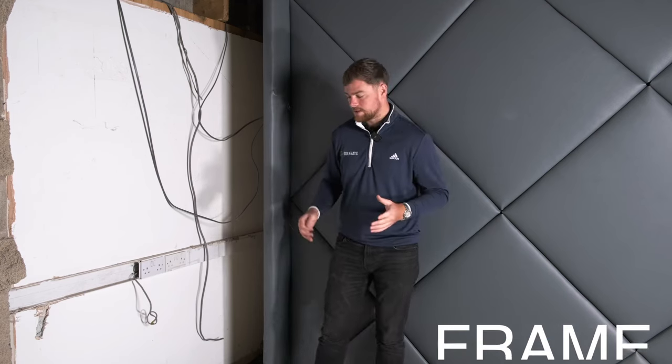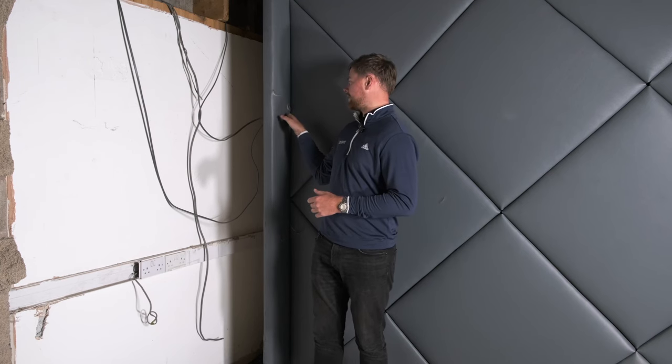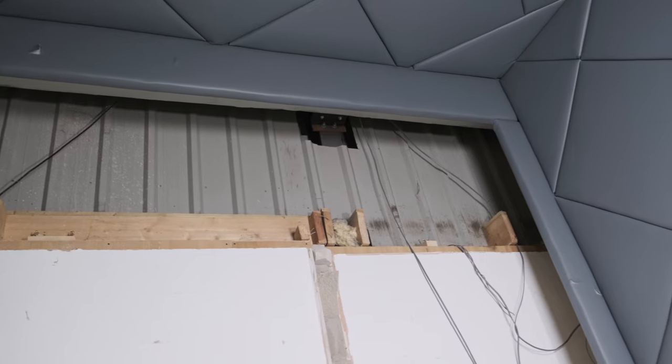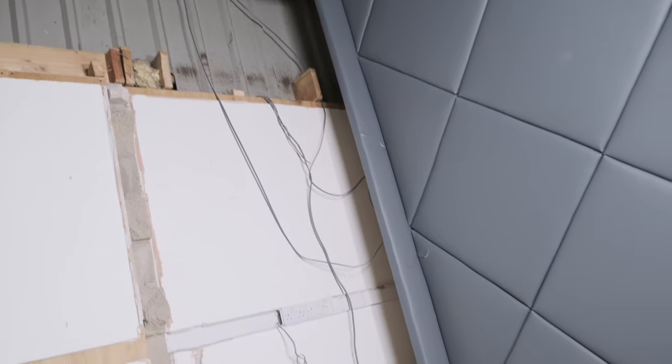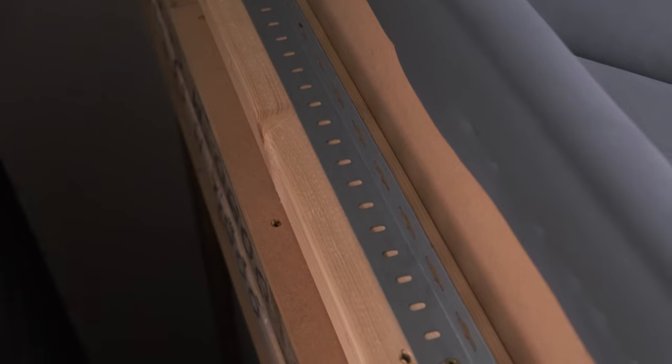The first thing you're going to need when you start hanging your screen is obviously a frame. When we do our installs and we're hanging people's screens we make a timber frame — this will be sort of inside the padding that you see. It goes all the way around the outside; the one we have is about 510 wide by 310 high, to fit our 5x3 screen. On the inside of that we use angled iron — angled steel called Dexion with holes in it — and that's how we actually attach the bungees and the screen to the frame.